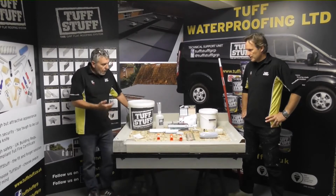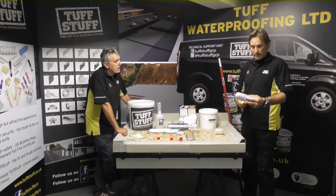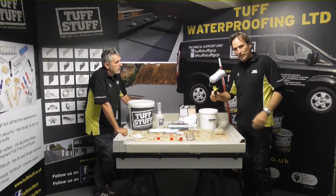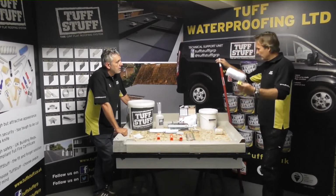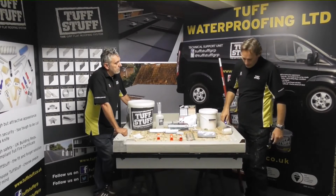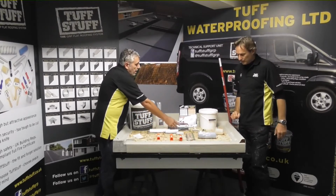So for applications of resin, Sean, we're going to use the... Yes, so we have a variety of different size soft rollers, we call them. They have disposable sleeves that you can change, so no problem. So we use these for applying the resin to our decking and to our laminate. So the larger one, preferably on the end of a pole, doing the field area of the roof, and then we have the 3-inch one doing bandage and detail as well. They're the ideal simulated lambskin rollers.